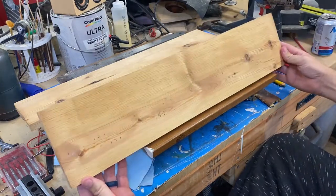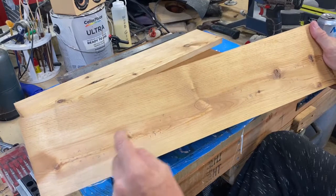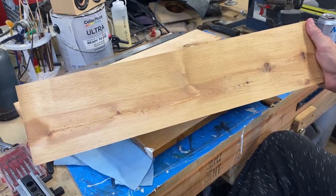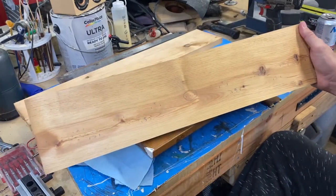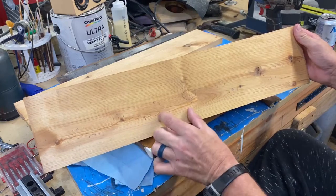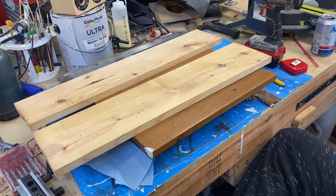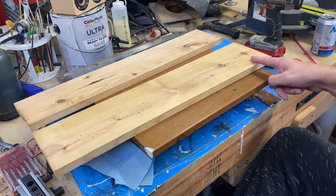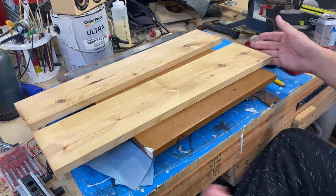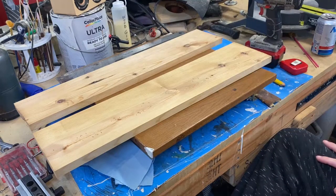After doing some math, I've laid out on this board two possibilities. If I want all eight divisions, I will only have two inches between the slats for screws. So I think I'm going to drop the smallest and the largest size because those are rarely used. By doing that, it gives me three inches between them, which will be a lot more room to grab in there and get the screws out. So we're going to have six spaces instead of eight. Now I'm going to work on the sides and the slats that go in between them.